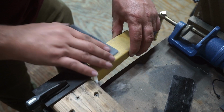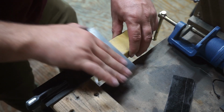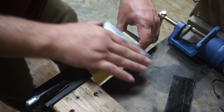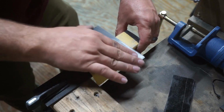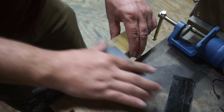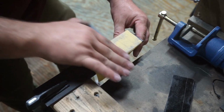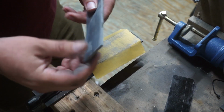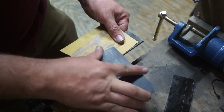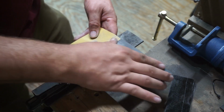So we're going to start this off by sanding everything that we're going to be attaching together. And what we're using here is a 220 grit sandpaper. The reason behind that is if you go too rough, like a 36 grit, you end up putting real deep scratches that end up showing whenever you get ready to do the finish work on the scales. Those deep gouges will actually show up in the layers, and it won't leave you real crisp lines.